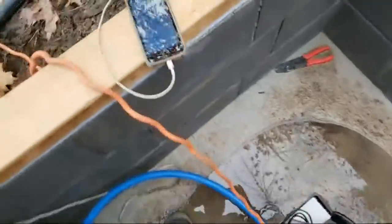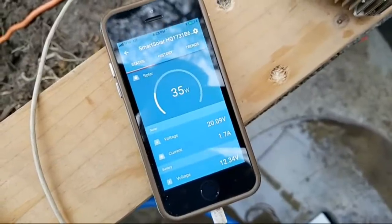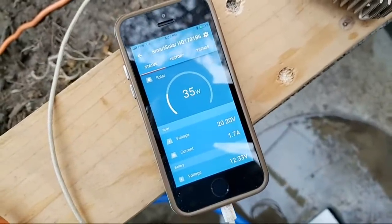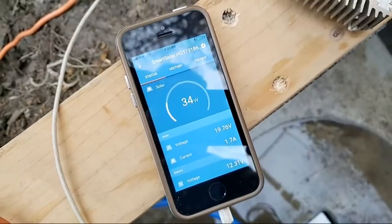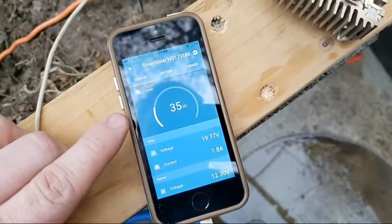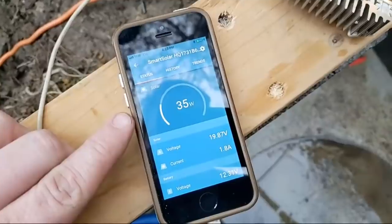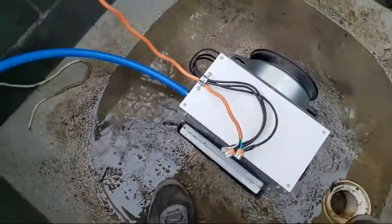The problem is right now it's only generating about 20 volts. So there's 65 volts minus 20 volts — there's 45 volts that we're missing out on, that we could be pushing more amps through that same wire. I don't know exactly what's going on there, but we are making power — it's about one-tenth of what I was expecting. We may also be needing more jets or a larger jet than what I have on there.